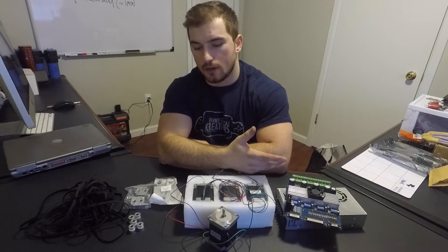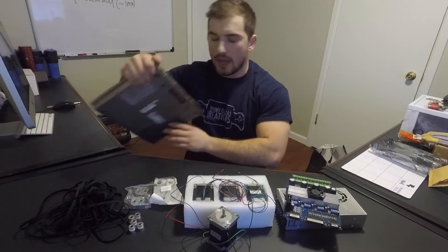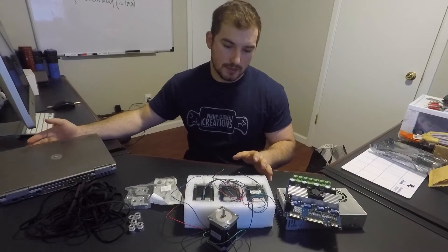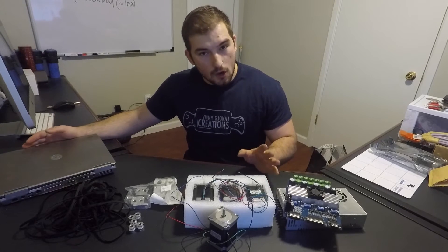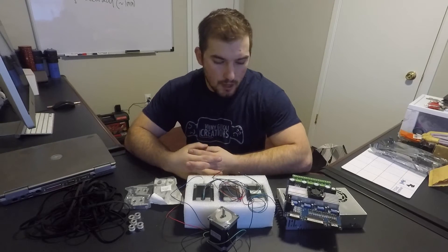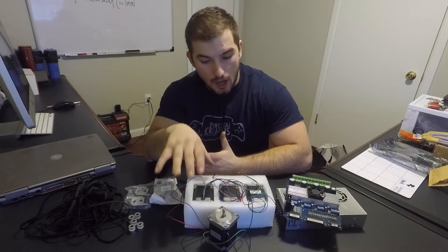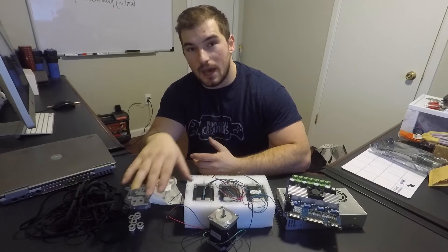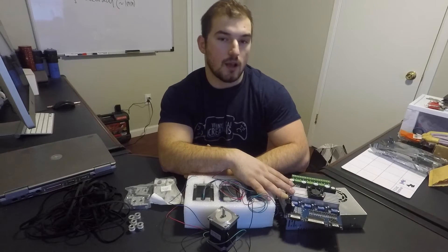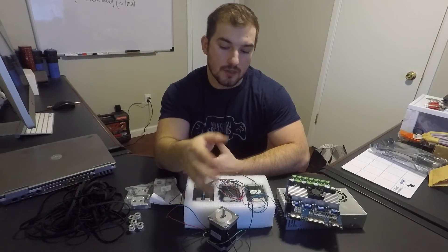Going this route I had to buy an old laptop that has the LPT port. I know I'll get this question, so I'll answer it now: no, you cannot use a USB-to-LPT adapter. The way the CNC software sends its signal out, you can't get the timing correct. Unless you get software compatible with that, the software that came with this controller is not. So if you go this route, the USB-to-LPT adapter simply won't work because of how the timing signal is sent.